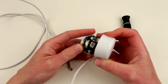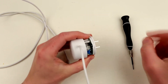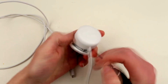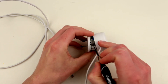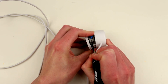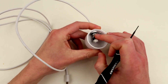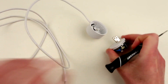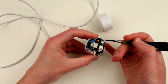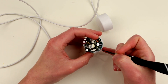This is how the Google Home Mini power supply — a micro USB power supply — looks inside. The wire is actually connected via a connector to the board — that's really, really smart, and probably aids in assembly big time. You can just disconnect it. This construction looks modular, which I love. We have what appears to be the primary transformer, probably a secondary transformer, a few capacitors, and what looks like a fuse.